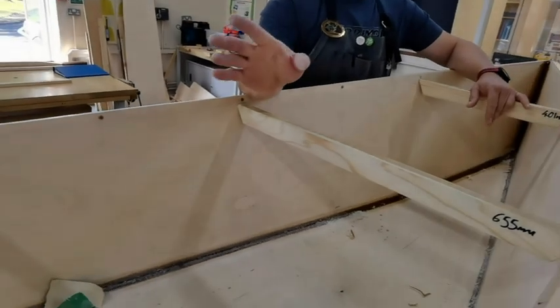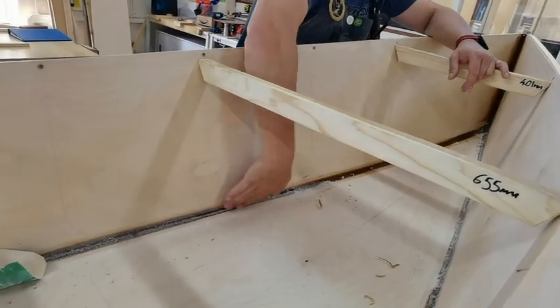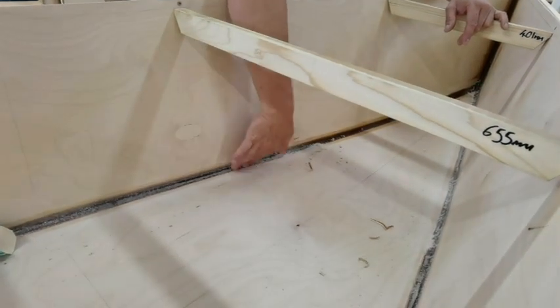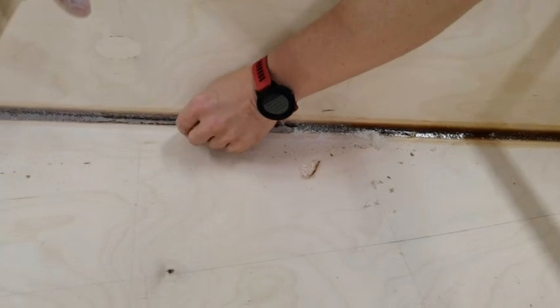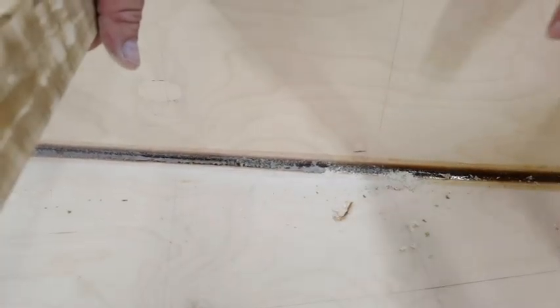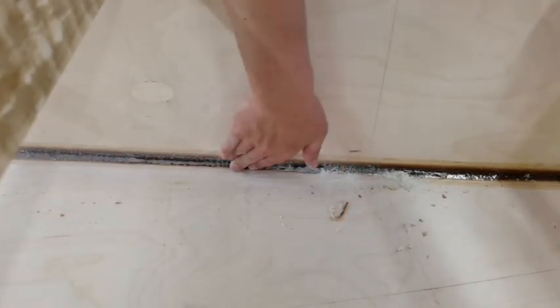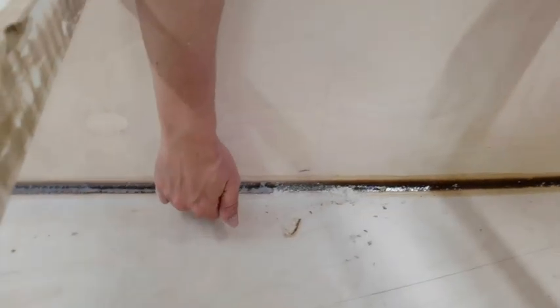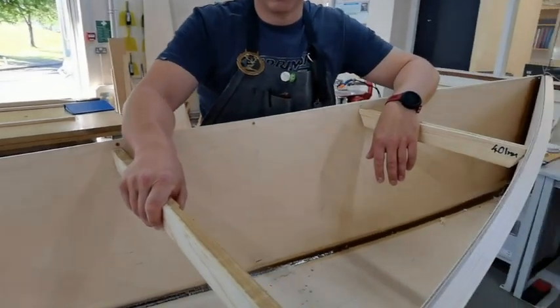I glued up Friday - late Friday I finished at 5 o'clock. I had done this fillet of the inside here, which is a mixture of sawdust and the colloidal silica, and it was all taped up to protect it. So I've come in Monday morning and cleaned the tape off, and I'm just sanding this a little bit, because I am going to glass fibre tape over the top of this here. I'm very pleased with it so far Mark, it's gone well. The strength is phenomenal.